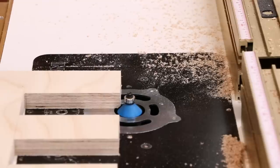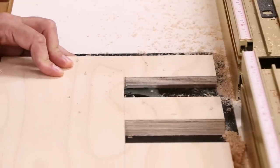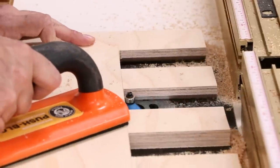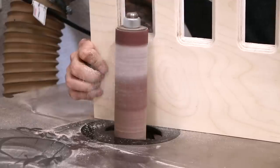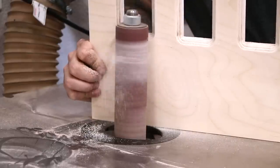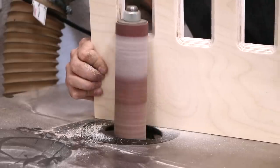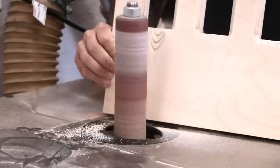To help cradle the drills, I'll add a deep chamfer on the top surface of the shelf. I found that the drills sit more comfortably if there's a rounded profile where the chuck rests, so I'll sand in a little round area using the spindle sander. Don't have one? Buy one. Or you could just try a round rasp.